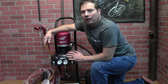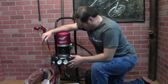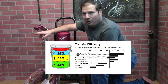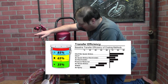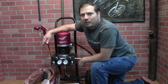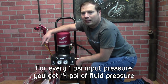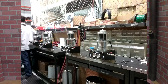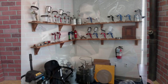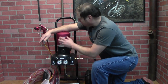What we have here is called an air assist airless pump and gun setup. The whole benefit around this is transfer efficiency of the coating and lower VOCs in the shop — that's the idea behind the technology. This was made by CA Technologies; this is their C14 pump, meaning it has a 14-to-1 pressure ratio. I'll explain more about that later, but I got to tour the factory and do training where they made this pump — it's made in the USA, right in Louisville, Colorado.